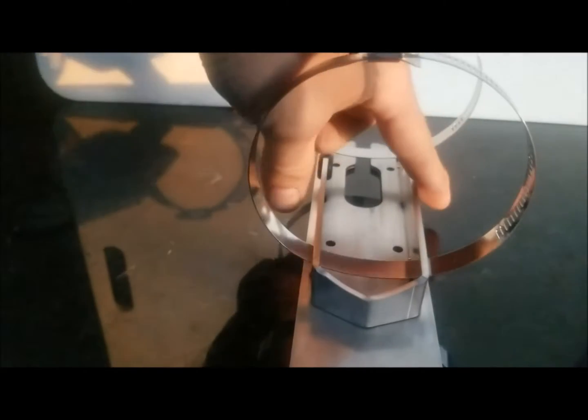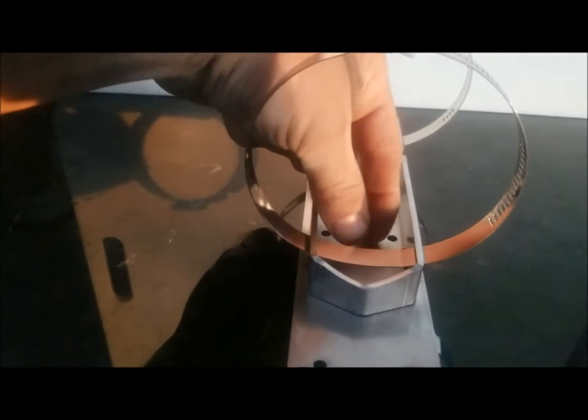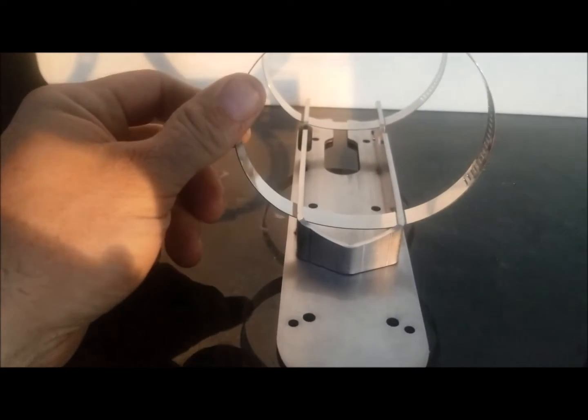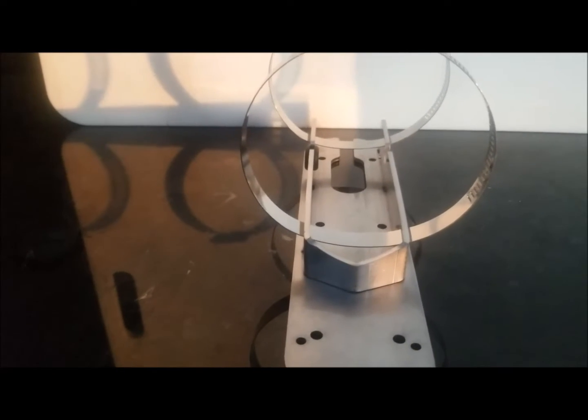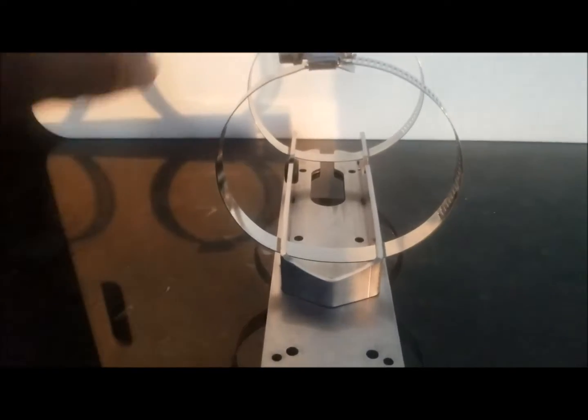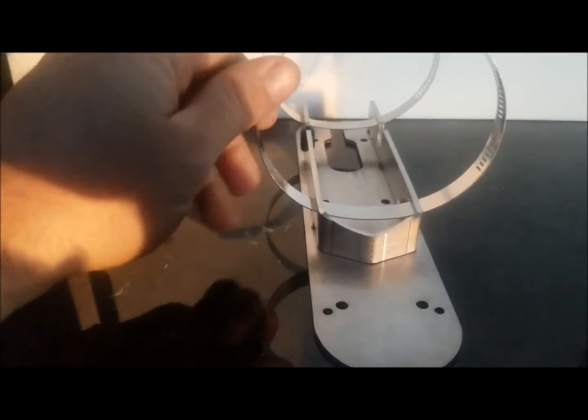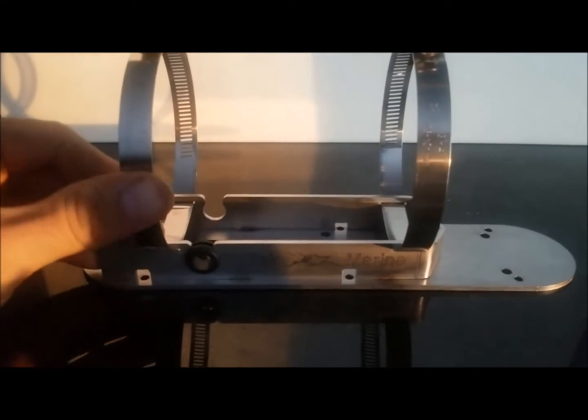Into the design, you'll notice that I actually made it wider in this part here than a lot of others, which only have to fit in between the holes where you're going to mount the total scan or the 3D or all those ones. They're the narrower ones. The 3-in-1 and 2-in-1 are the narrower holes. Usually the brackets are only about 3/4 inch wide there, and so there's not a whole lot of stability on the bottom of the trolling motor. That was something that I wanted. So with the wider, you get a bigger footprint on it and more stability. So you can see there it's pretty wide. Yeah, so it works out well.